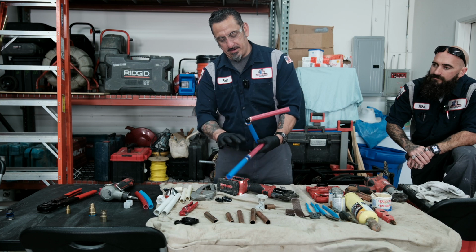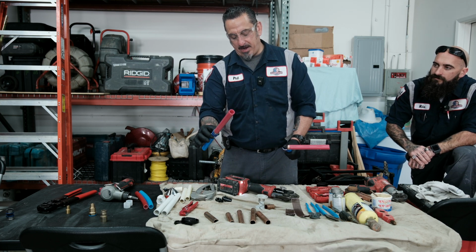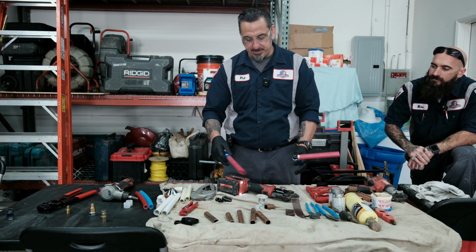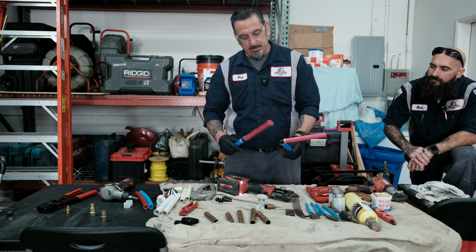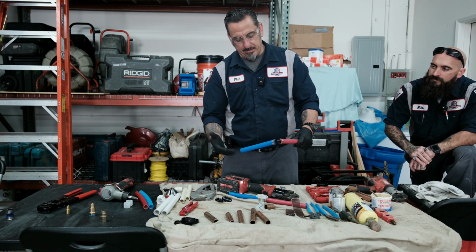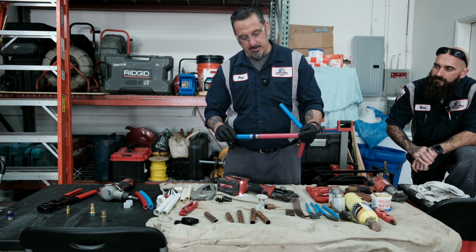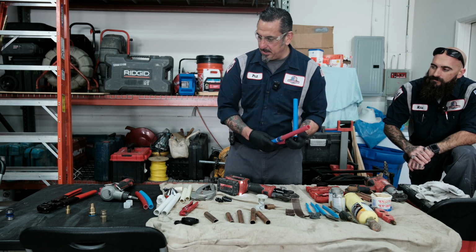These two are the crimping process. This is actually very much the most popular one, but you do need to get the tool with the assortment of heads from 1/2 inch to 1 inch. You can also get bigger sizes with the crimpers. This is something that's very accessible for any homeowner to go down to the do-it-yourself center and get. This you're probably going to need to order from a contractor supply house, but they are accessible to the public.